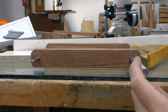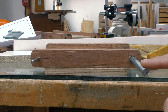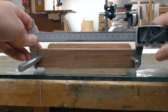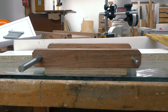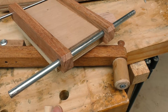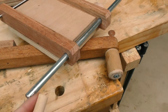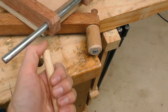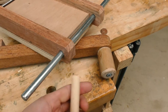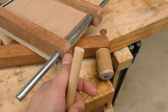So one of them is off by one millimeter. I think it's the 10 millimeter one because I had a little bit of trouble lining up the holes when putting the rod through. The other side is 188, which gives us 180 between centers — which is perfect. So I just need to redrill that one hole. I'll have to fill it with a piece of wood first. I could have just used a dowel, but I don't like that idea because when redrilling a hole you're drilling partly side grain and partly end grain, which can cause the drill bit to wander off slightly. So instead I'm going to make some dowels with the grain in the same orientation as these links.